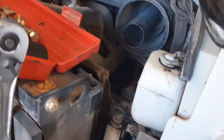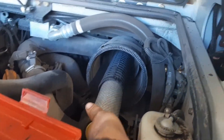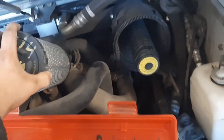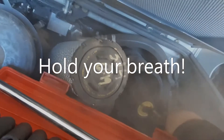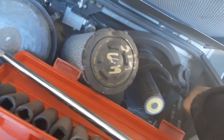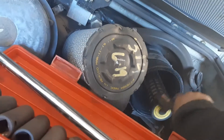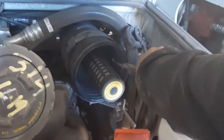This is the part where we do not want to be blowing anything until we get our inner cab filter back in. I'm going to set the outer filter off to the side. The inner filter is now in place, popped in and secure, nice and flush — so now I'm going to blow out the outer filter. There we go — now we've got the lid.